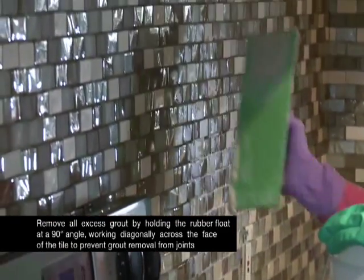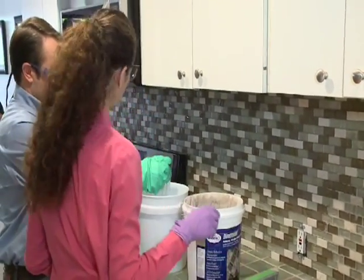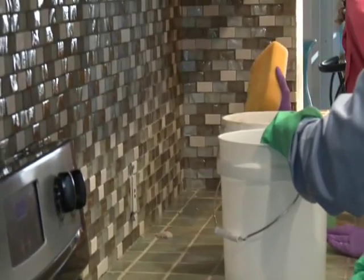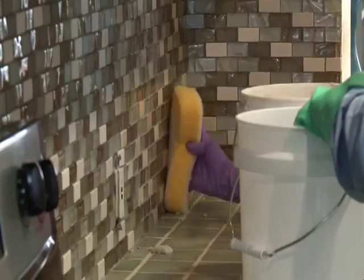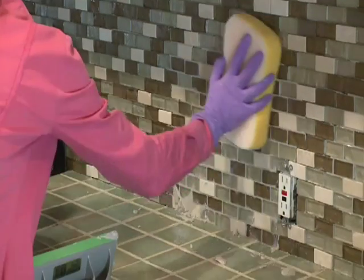When you're coming through for that final squeegee step, hold the float at 45 degrees and just come up. Now take your sponge, do a wipe — making sure all the water is out — and hold the sponge flat and go with some nice wide swipes. That's it. You continue down the wall using that same process. It's so easy. Scott had me feeling like a pro. Not only could I do it myself, but I was enjoying it. All my fears of botching my project vanished once I started applying the grout.